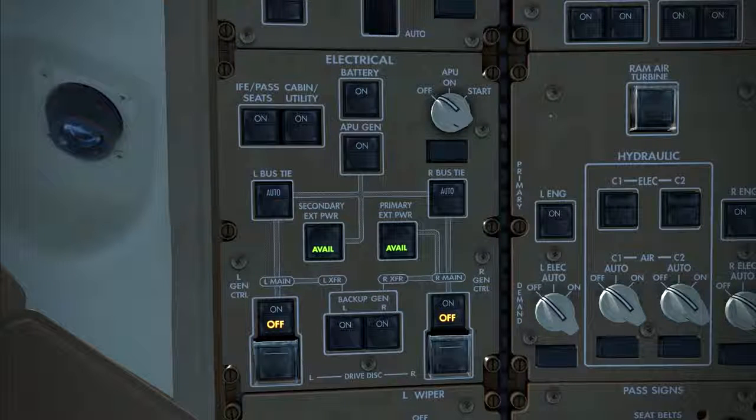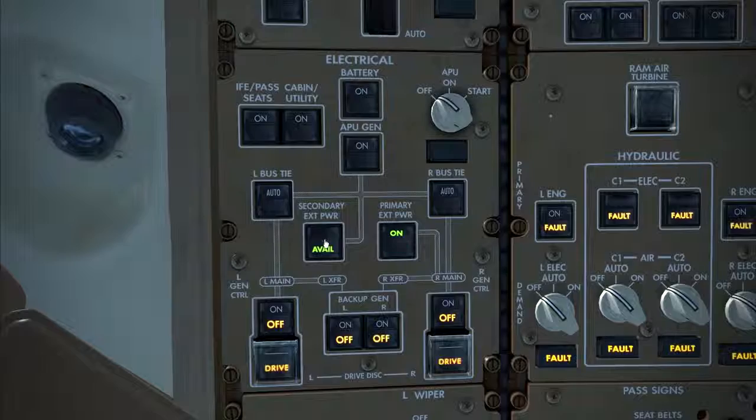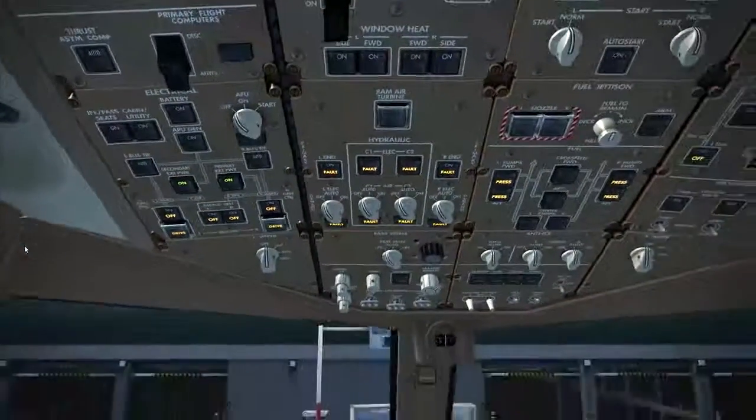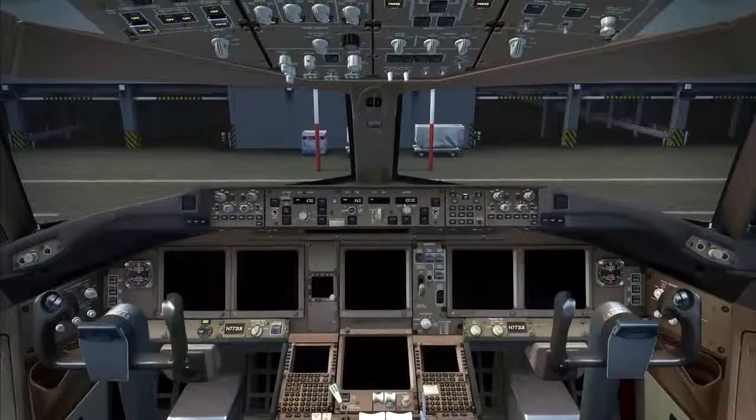it's highly likely that all of the aircraft's galleys will be rendered inoperable due to load shedding. Attaching two GPUs also helps reduce heat buildup on the electrical load management system power distribution panels. Select both switches on at this time and notice that the aircraft springs to life. This completes the electrical power-up supplementary procedure. We now have a fully powered aircraft and are ready to continue.